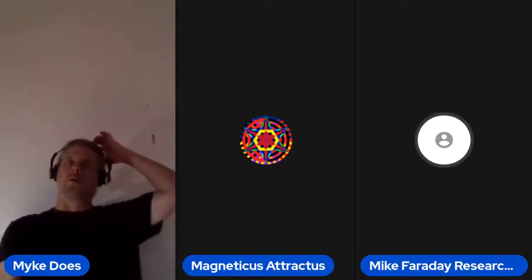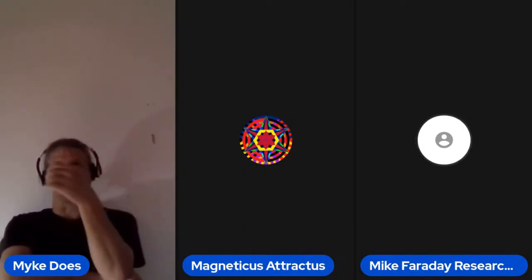Why did you choose series? Because it's creating current. So I've got the high voltage flyback board that's creating high voltage but very little current. So the current is merging with the coil. The coils are providing the current that the board doesn't have. And they're merging together as one. So now it makes sense to put them in series, because your flyback voltage is really high voltage. So having your coils in series makes more sense.